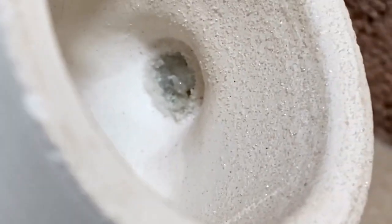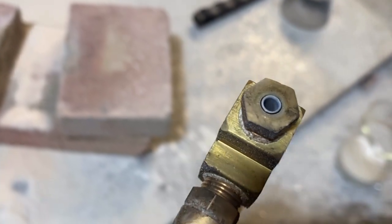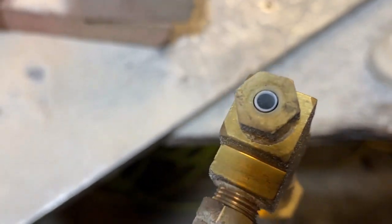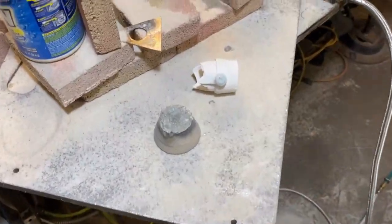I'm gonna take a look at this thing - seems I can touch it. There's the backside plug; it even has some overlap like it's riveted itself in there, so that would be a very good furnace plug. That is just too cool. The tip looks a little hot, a little scorchy - but I'm not seeing a bunch of sugaring or anything like that, so far so good on the tip. Those are the two artifacts we've been able to make. In order to accomplish that, we needed to hit 25 to 30 amps on the HHO to get that heat - you can't do it on 20, it's just not enough.